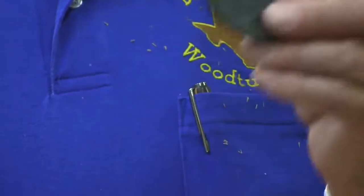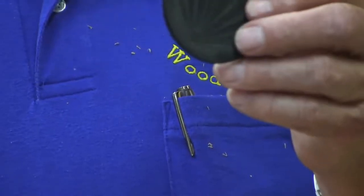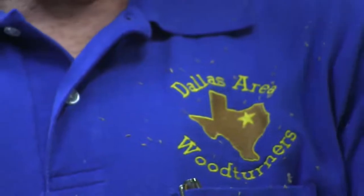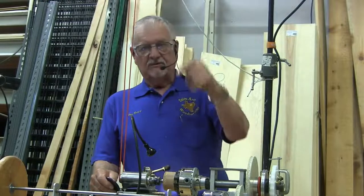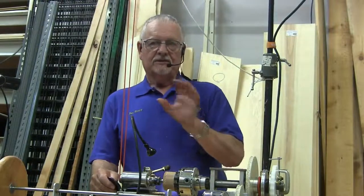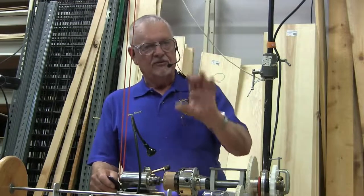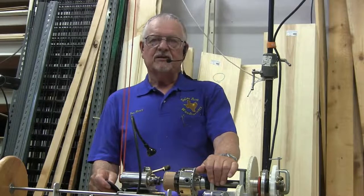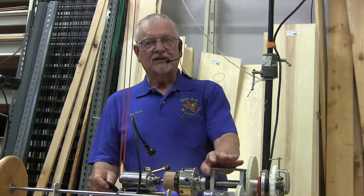Yeah, definitely. And you can take some wood that's kind of punky and stabilize it. You just put a layer of thin super glue over a lot of punky wood and it will stabilize it a lot. Thin super glue works, especially when I cut threads. I can cut threads in some pretty soft wood, and when I get it shaped the way I want, ready for the threads, I'll run a drizzle of super glue all the way around it, let it cure good, cut my threads, and before I change anything, I go back and run another layer of super glue in it, let it dry, and then run my cutter across it one more time, and it makes a pretty good thread, surprisingly, in some pretty punky wood. Super glue goes a long way. But you want to let it dry before you stick it together, because you may never get it apart.